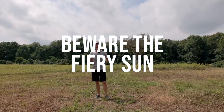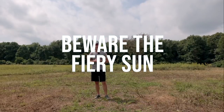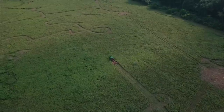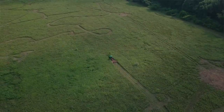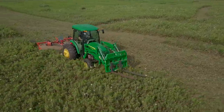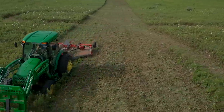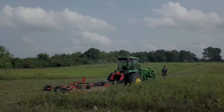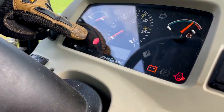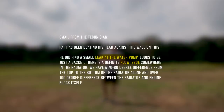Let's flip from the dead of winter to the dead of summer. We had major problems with a couple of pieces of equipment recently. The first one: mowing with the 4720 and the batwing mower, with some serious overheating. The needle was slowly creeping up but still in the green, so I turned it off to take a break and clean the grill — there wasn't much on it. A couple minutes later I turned it back on and all the signals were blaring. It was overheated: red stoplight, high temp on the dash, needle buried in the red. It turned out that tractor had issues with the water pump, maybe the thermostat, and the whole coolant system that we're still dealing with.